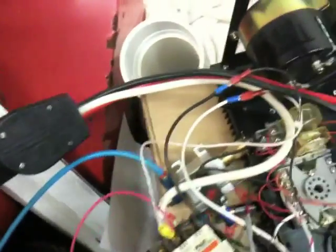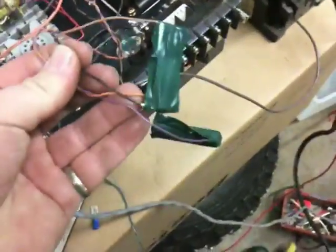We've got a 50 amp welder feed coming into an SCR bridge for our rectifier. It's a 60 amp bridge. The SCRs are run off of two AAA batteries. This is a three-phase bridge.